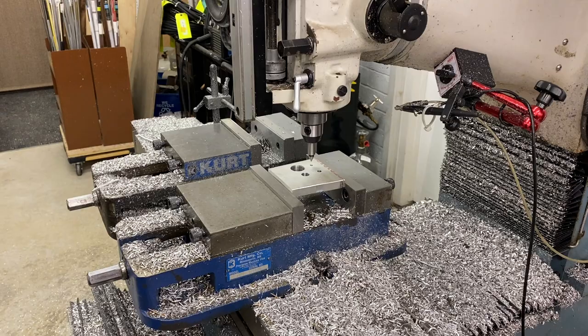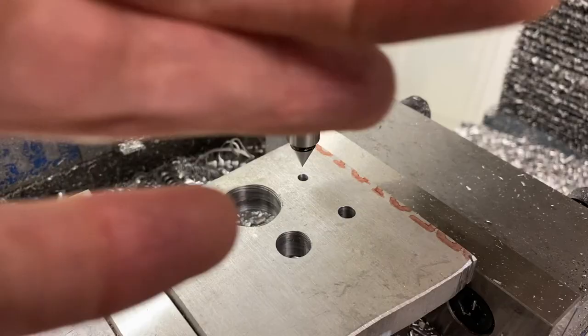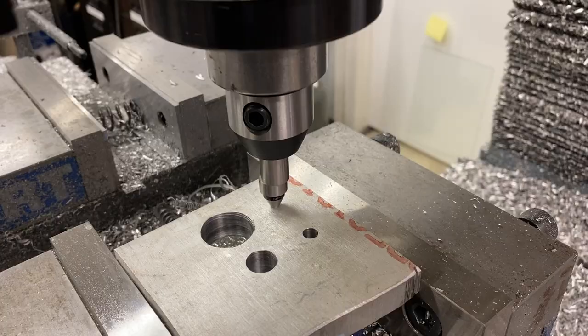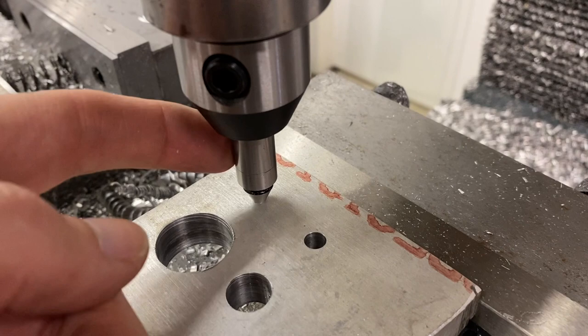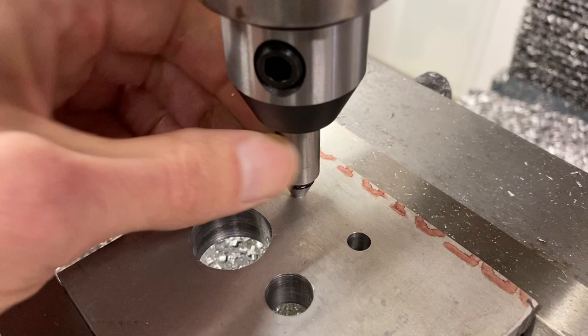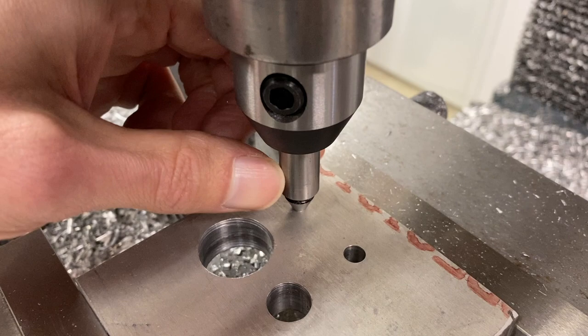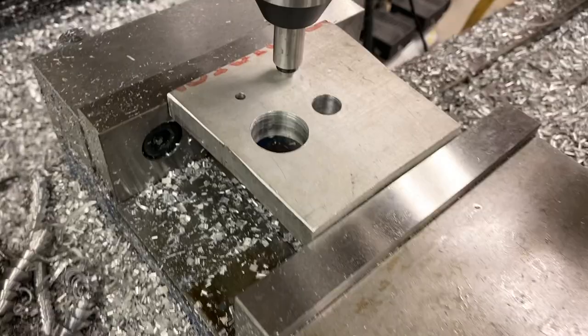We have a series of holes drilled as an example. The floating-tip center finder is really good for small holes — up to about 300–350 thousandths or so. The tip conforms to the hole; you lock your quill and move the table around. You match the body diameter — this half-inch diameter of the tool — to the tip diameter, which is also half inch. Now that these are matched by feel, you are within a few thousandths of being on center. If that tolerance is enough, you do your operation and move on. If you need it more precise, zero out the DRO, remove the tool, and go in with an indicator.